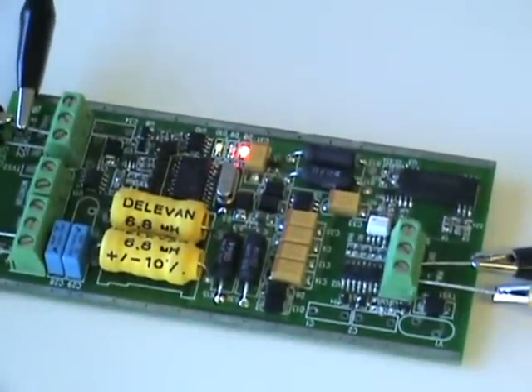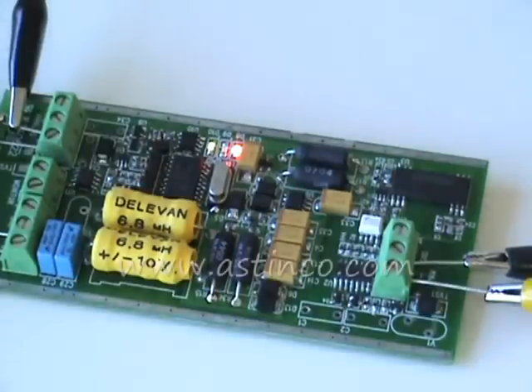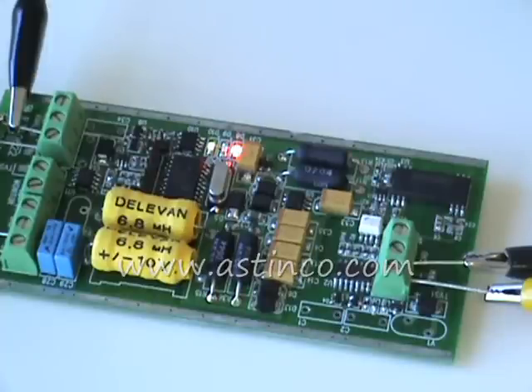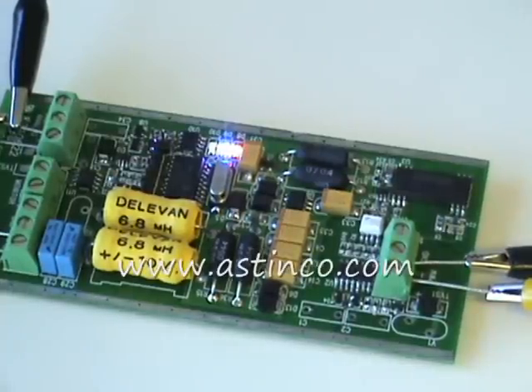If I go back to the board — the red LED is always on, and green shows the duty cycle is within normal range of 7.5% to 45%. If I increase the duty cycle beyond 45%, you can see the blue LED comes on. Blue LED means the duty cycle is more than 45% or less than 7.5%.